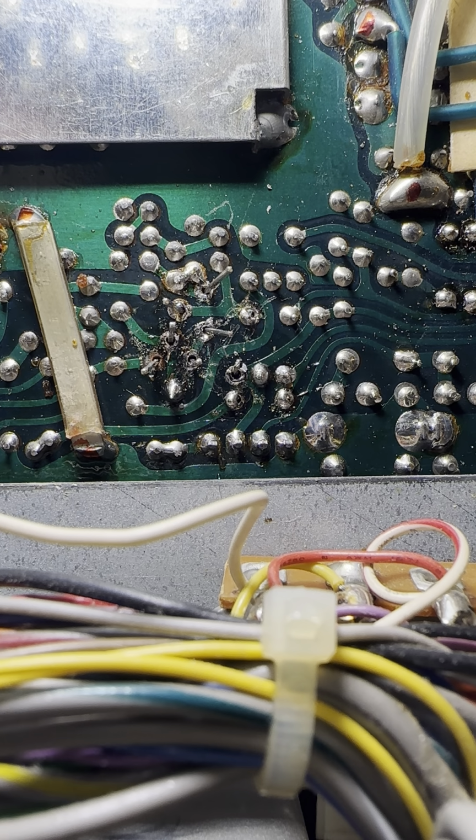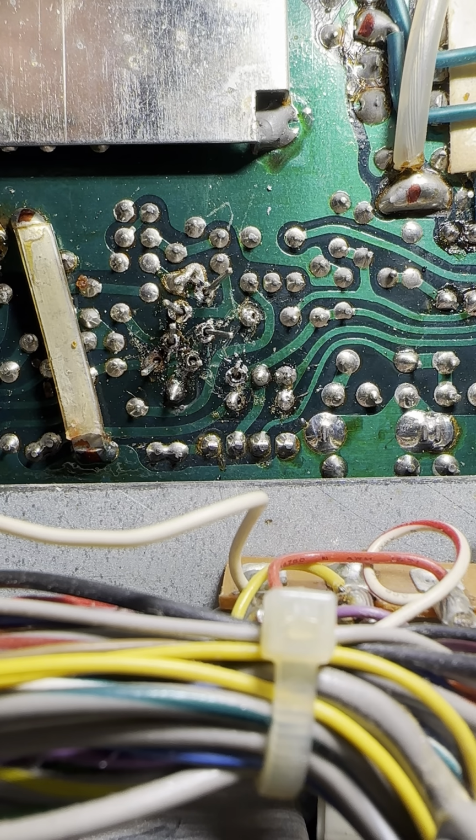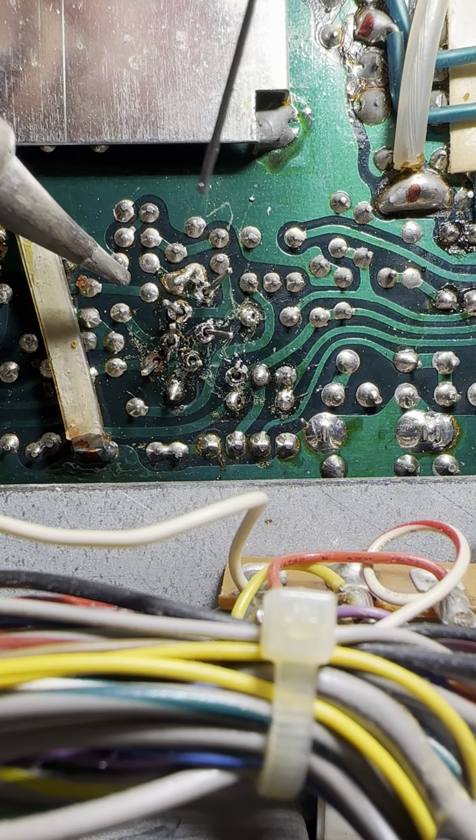All right, let's locate them. There they are, a bunch of wires coming in. Can't see, can't get in there. So the trick is you don't want to bump these things vertically. You want to just, damn it, there goes my ground. Don't bump them vertically, just get some solder on these things and be done with it. With a grounded iron, I hope. I don't want these things popping back out.